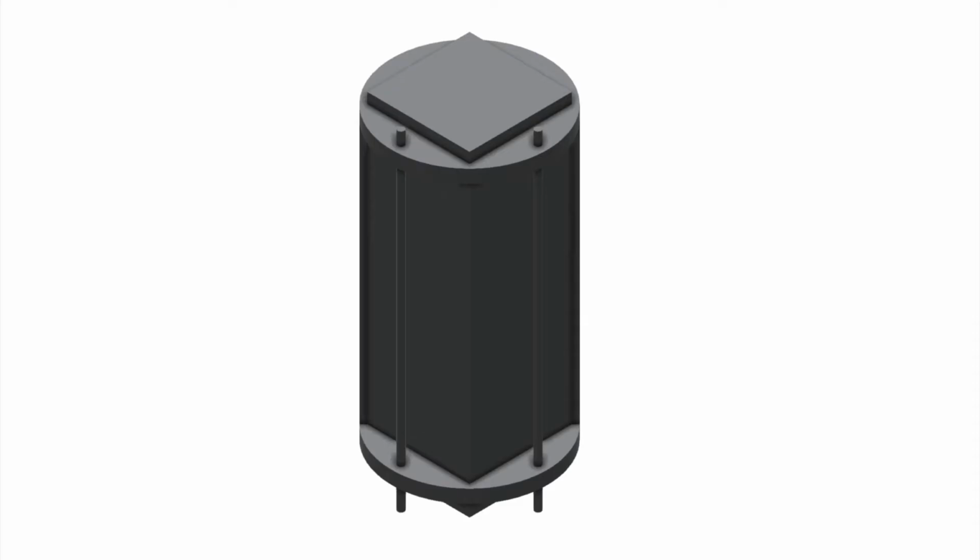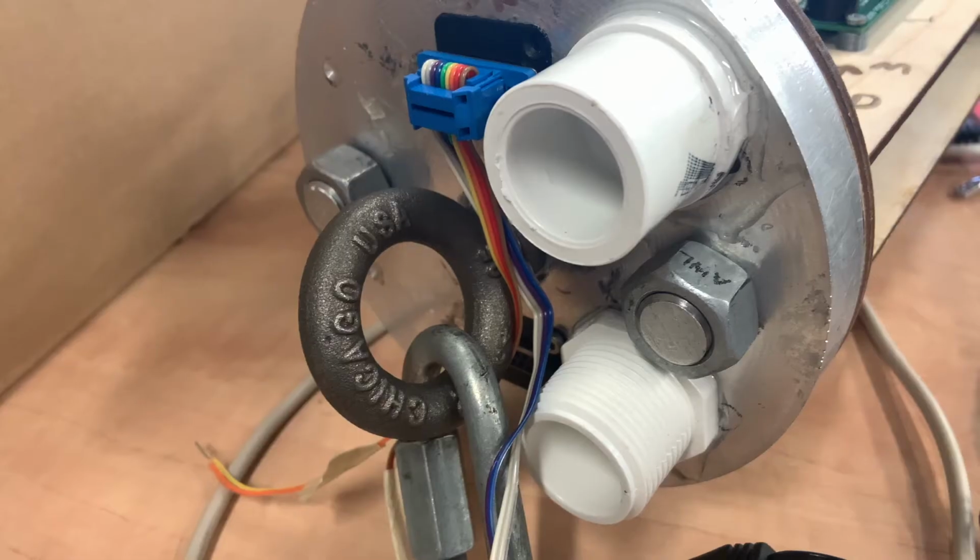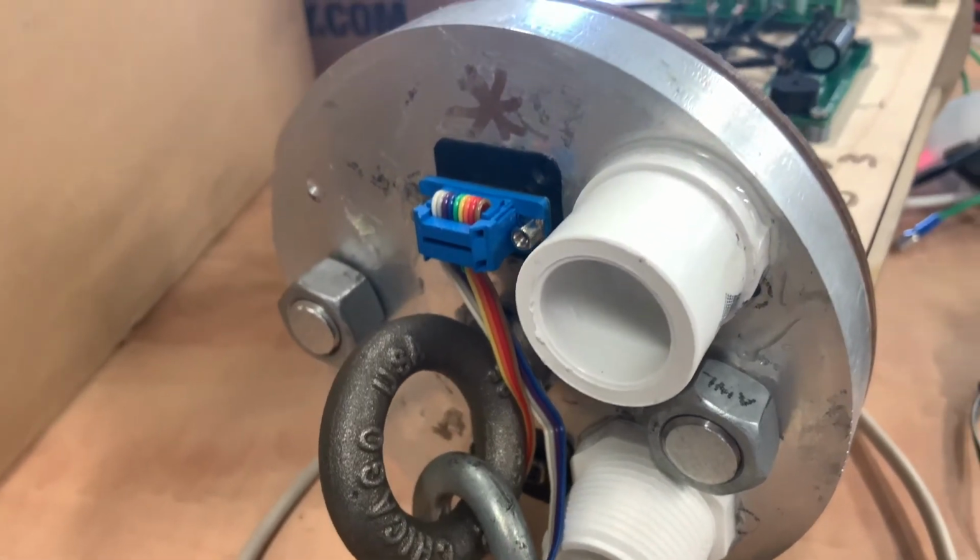The structure of the payload bay is comprised of 2 plywood discs and 2 steel rectangles. The payload weighs approximately 8.8 pounds and houses our experimental payload, which is the Genesee beers. The avionics bay is located in the upper tube of the rocket, and it is designed to be easily removed and inserted back into the tube.